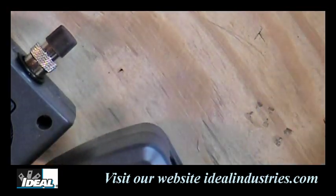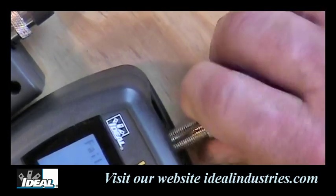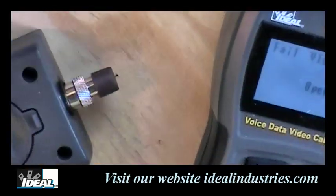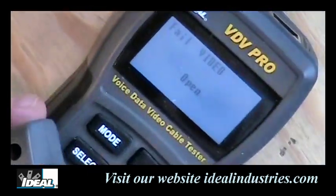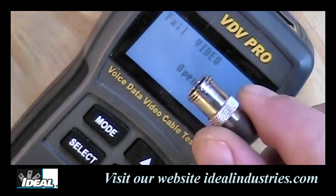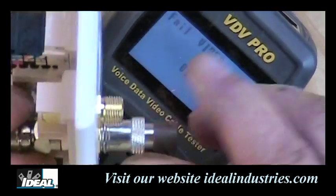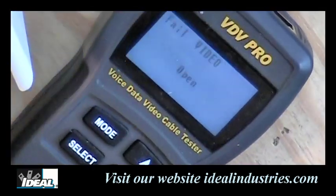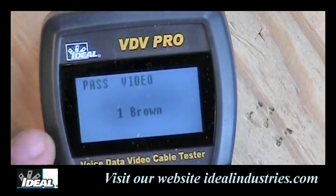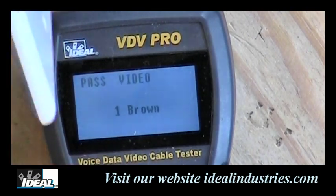Okay, I'm going to take this piece of coax here and plug that into the end there. Tighten her down. And what I can do on the other side here is the remote here has a coax insert that we can pull out the bottom of it, and I'm going to plug that into a wall plate over here that's got the other end of this coax plugged into it, okay? And then we're going to run a test on this piece of coax, and you'll see the tester is saying pass.